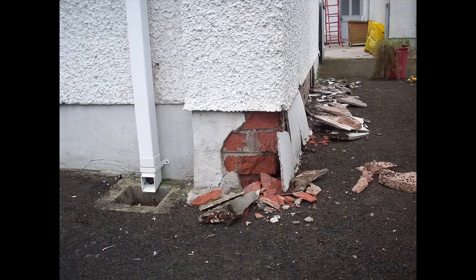You can see that even the patched cornice — it was a proper plaster cornice — painted in 100 percent. A friend of mine and I were talking about a job recently where there was a damp patch, and we were discussing tactics for re-plastering. You could patch, but I prefer to cut it out and completely plaster the whole lot so it's a seamless job. A patch is a patch.